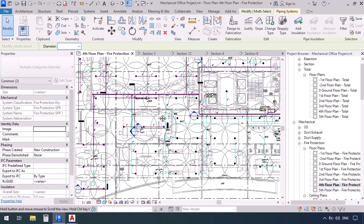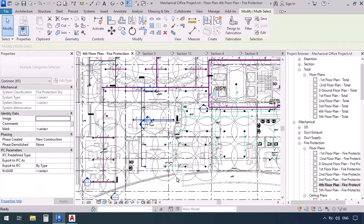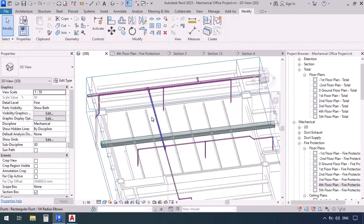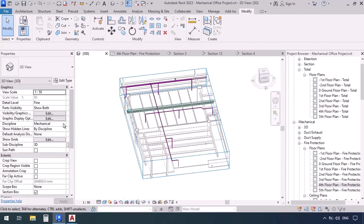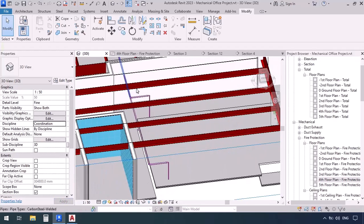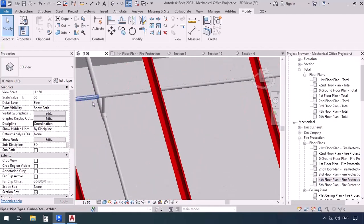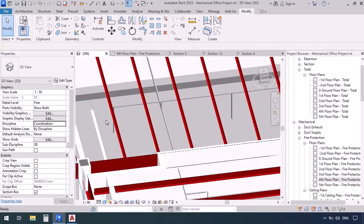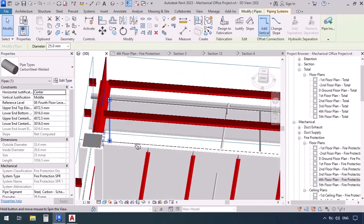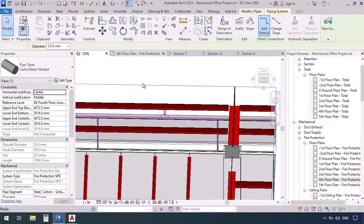Now I can just try to view this entire area in 3D. To double-check stuff, I'm going to select this area, then press BX. Now we're going to take a look in the selection box and see that everything has been connected properly. To have a better view, we set the discipline on coordination — we want to see the architectural better. As you can see, the connection here is proper and it's going below the beam. The connection is fine here as well, and everything else looks fine. Also, this first one — we connected it by using flexible pipe. And all these other pipes are going downwards and connecting to the sprinklers.